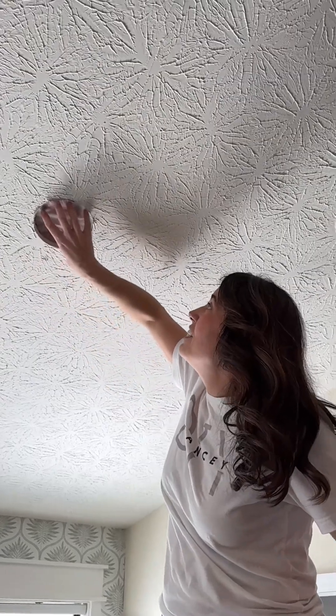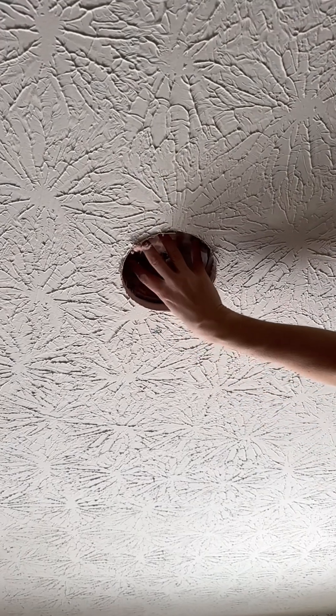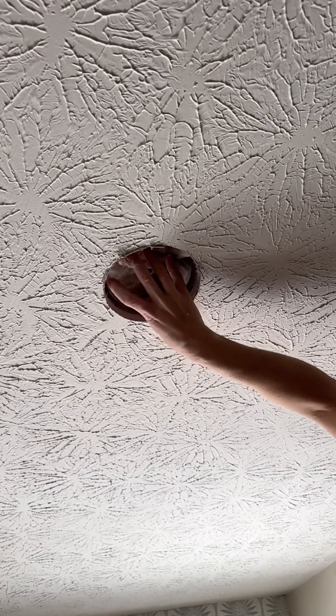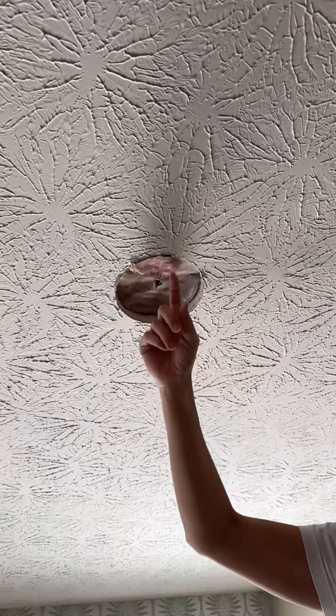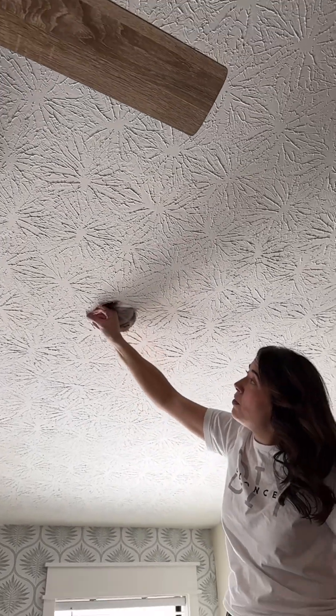You can see it cut a six-inch circle out of my drywall — the drywall was about half-inch thick. This is just the insulation in my ceiling. We're gonna push the insulation up a little bit to run the wires over there, and then this new light will click on.